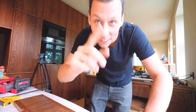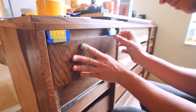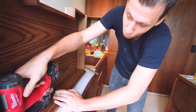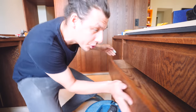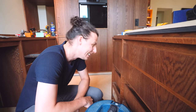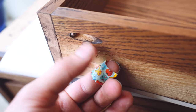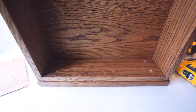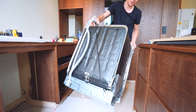After all that hard work, all that's left is installing the fronts onto the drawers. The method that works best is to align everything based on measurements, and then hold it in place with some really small 23-gauge pin nails. That's enough to hold it in place so you can double-check that you did it right. This wasn't planned, but I clearly didn't get it right — luckily the super tiny pin nails are very easy to pull back out, so you can repeat the process and hopefully get it right this time. Now that I know it fits, I take it back off, properly attach it with screws, adjust all the gaps so they're perfectly lined up, and then it's onto the last front — the dishwasher.